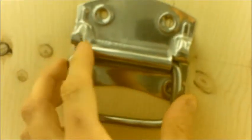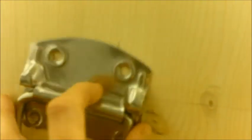As you'll notice, before you start prepping the coats, I've marked out the center line for my handles. See the center line here, that's basically what I used. I used my engineer's square and lined up the center line across, so it's bang on center. Because this is 400 mm, mark out the 200 mm, which is dead center of the width of the side of the box. Then I placed the handle like so, and marked up my drill holes where it lines up.